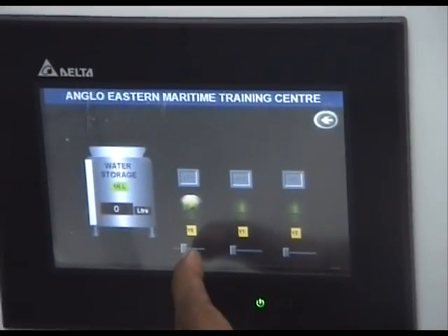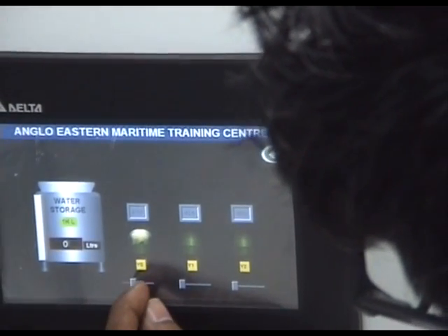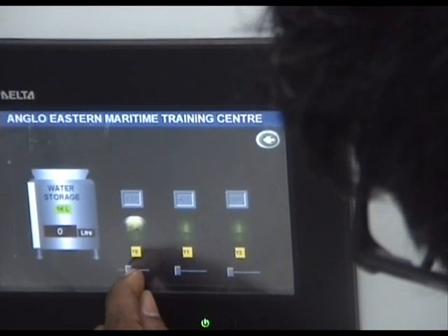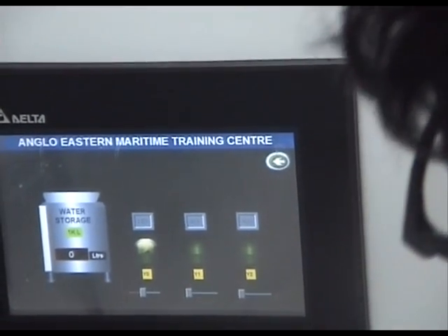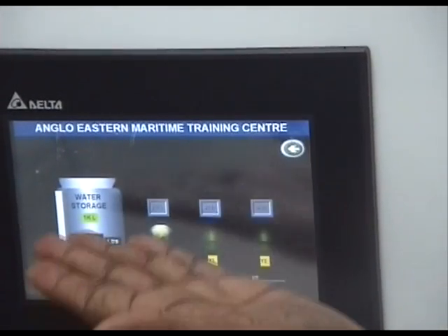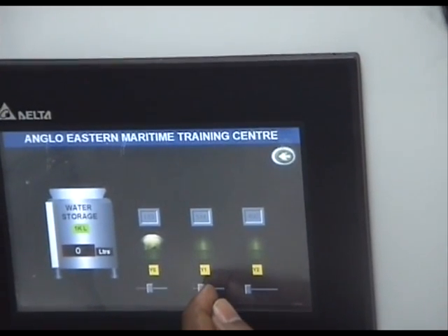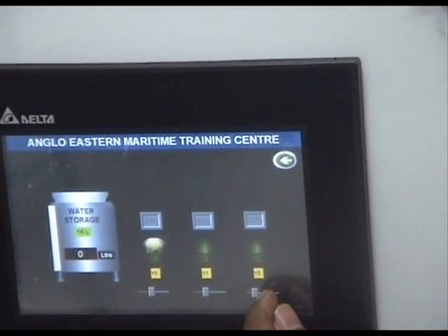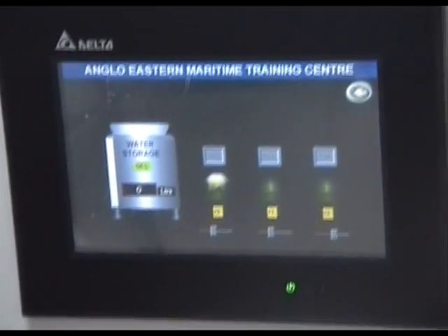I have a comparative set point here. By moving the slider I can make this adjustable. I have adjusted this to roughly 183 — that means when the water level comes above 183 this low level alarm will go away. The middle level alarm for Y1 I will adjust to above 600, and the high level alarm to about 700. I am going to start increasing the water level.